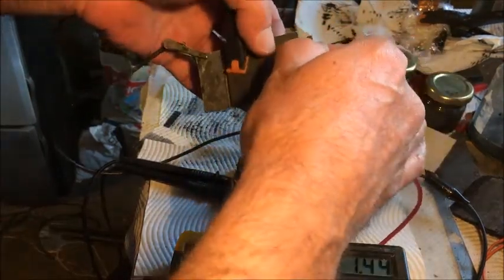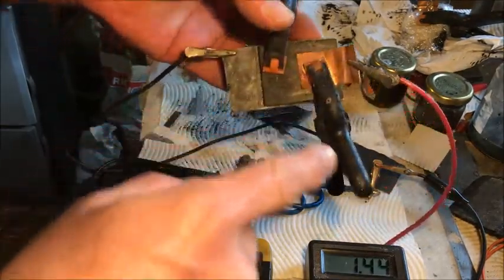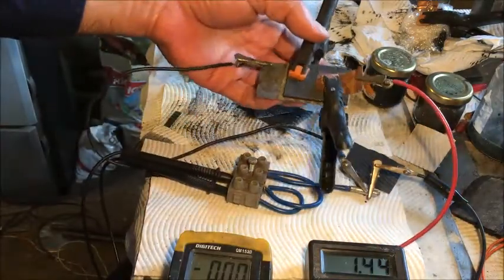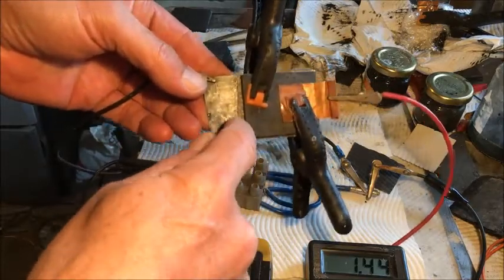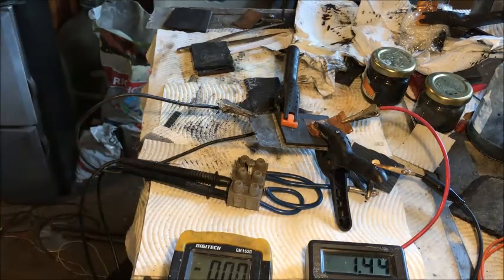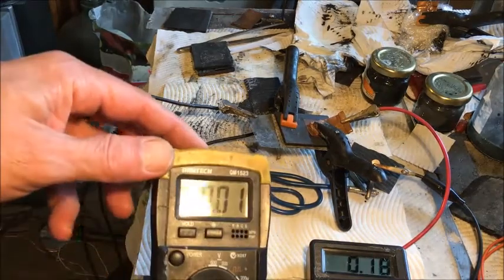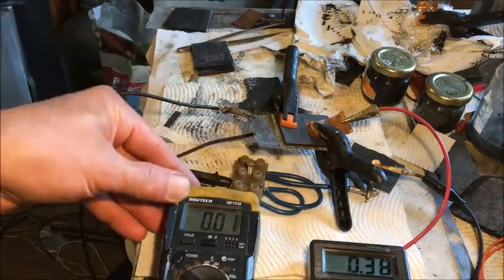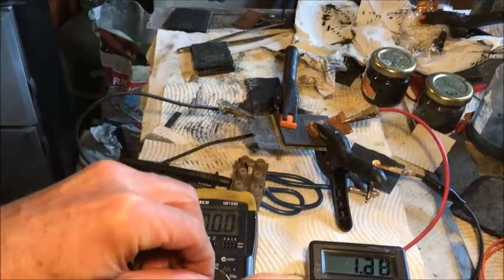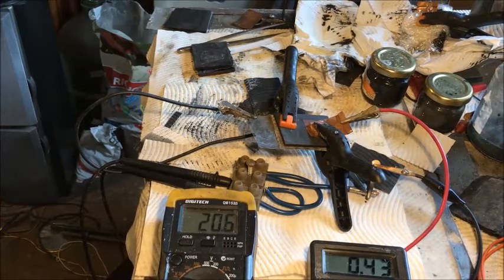This cell has been idle for about four or five days. One problem is you have to clean under the pad if you get any electrolyte on the copper pad, because it corrodes it really badly, leaving a badly oxidized surface. It's bone dry, almost like a crystal cell now. It's holding 1.4 volts — I gave it a quick charge three days ago — but milliamps are down, probably only 20 milliamps. So not too bad for a dry cell.